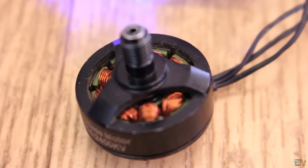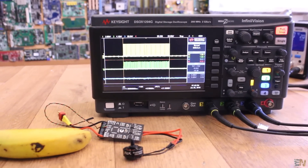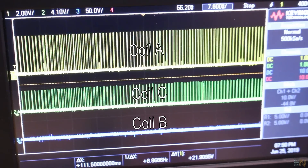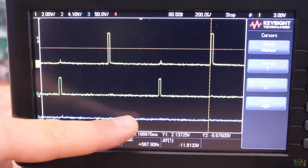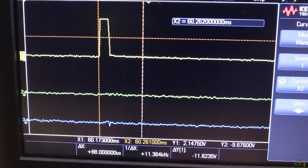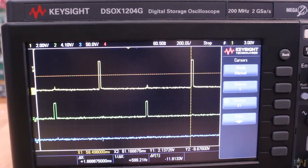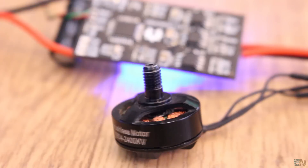In case you want to know how the beeping signal looks, here it is on my oscilloscope. I first thought this was a simple PWM pulse, but to make the coil sound, you have to alternately commutate two coils. We activate the ground side of the B coil and then alternately enable A and C coils with pulses of 20 microseconds and then 480 microseconds of pause. The entire pulse is 110ms and that's how we make those beeps.